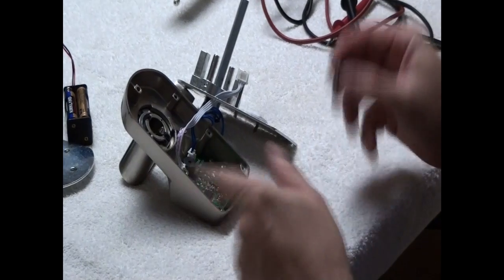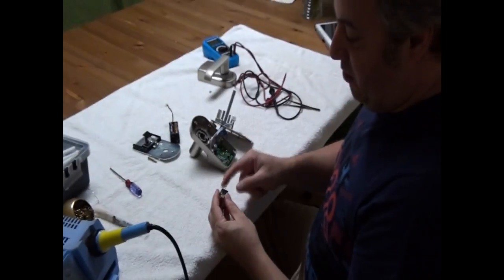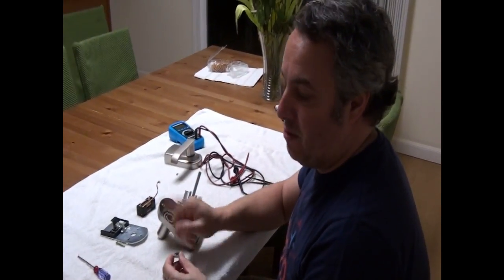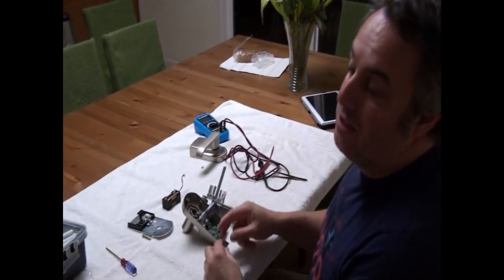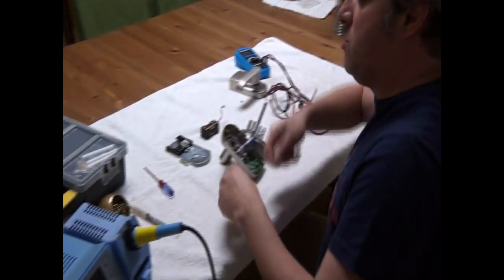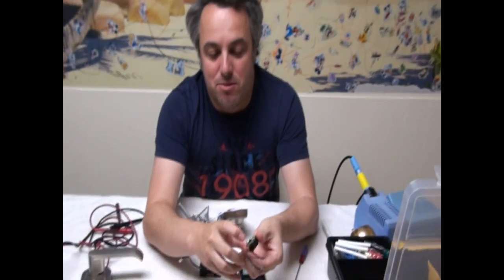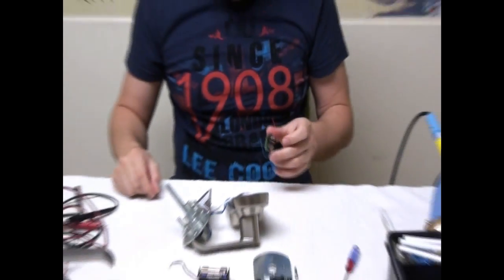Now I'm going to create a wrap around this module, because there are two problems. This module needs 3.3 volts, while the lock is operating at 6 volts. This will burn the module, so we need a converter. And second, to use the GPIO from the module we need a transistor, so a small circuit has to be assembled. This is the final assembly module. It has a 3.3 volt converter and a transistor to turn on GPIO.